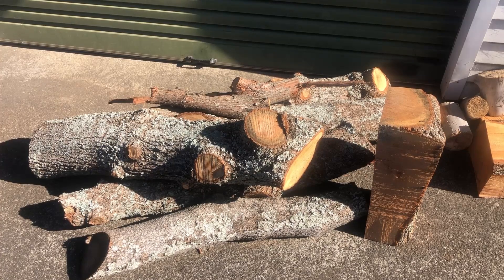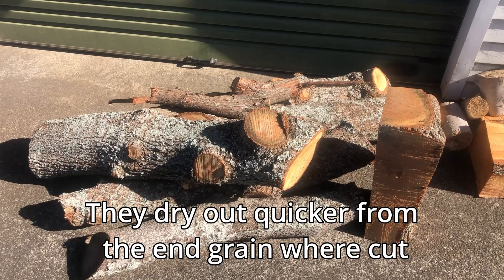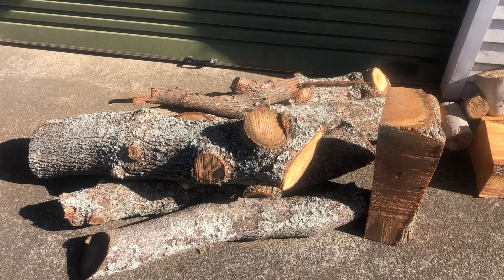I've come across a couple of opportunities where I've received some free wood, and for woodturning you need to prepare this wood. The logs have been cut off a tree and the problem is they will start to dry out where they've been cut — they dry out quicker from that point and that causes cracking. So I need to cut these logs up into the sizes I need and seal the ends to slow the moisture loss from the end grain. As you can see on the right, I've started chopping some of the larger logs, but it was a hassle keeping the log still from rolling around and there was a risk of the chainsaw going into the dirt and dulling the chain.